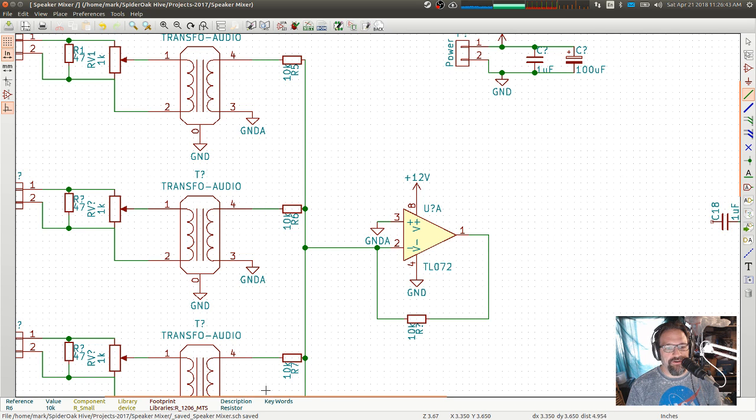So if I've got 10 volts here and zeros on all the others, then it's just 1 milliamp going through. But if I've got 10 volts here and let's say a minus 5 volts here, right? So I've got 1 milliamp coming in here, and I've got half a milliamp going the other direction. I'm drawing current out of the circuit. So by the time it gets here, it's only half a milliamp going toward the op-amp. And so half a milliamp here means it's only minus 5. So I may be rambling here, but that's how we're mixing all of these inputs into a single common signal. And then the output of this is an inverted version of the sum of all of those signals.